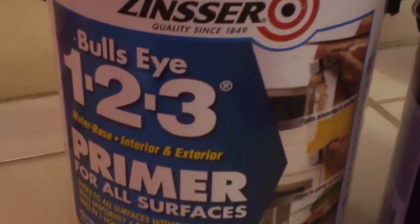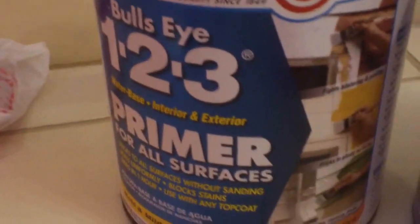To start with I went to Home Depot. I thought I would be able to get a better product than this — I saw some better stuff on other YouTube videos. What you'll need is a high adhesion primer. In my case I use this stuff here, and it says right on it that it will adhere to tiles. It says on the back that you don't really need to prep the tile — you don't need to sand it or anything.